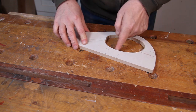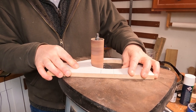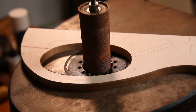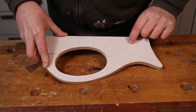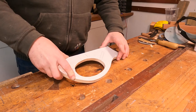So next we'll get this on the bobbin sander and just get this cleaned out to a bit of a nicer shape. So there's the control cavity hole cut in the template. There is also this other little section marked on the template, which is a cutout to enable drill holes to be put in for the wiring to go through. Obviously that will be sat underneath the pickguard, so it isn't visible on the standard guitar.